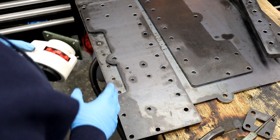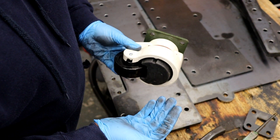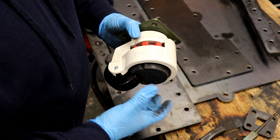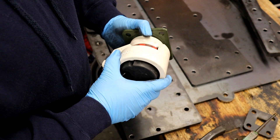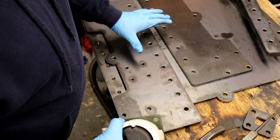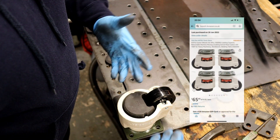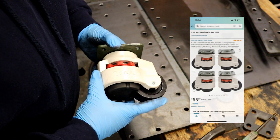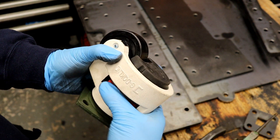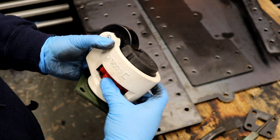Now let's talk casters. These aren't run-of-the-mill office chair casters — these are industrial, self-leveling adjustable casters from Amazon. The combined weight rating for all four casters is three tons. I'm of the strong opinion that nothing too strong has ever broken. These have adjustable levelers so you can get clearance when moving the machine and then take the weight off the casters via the adjustment screw.